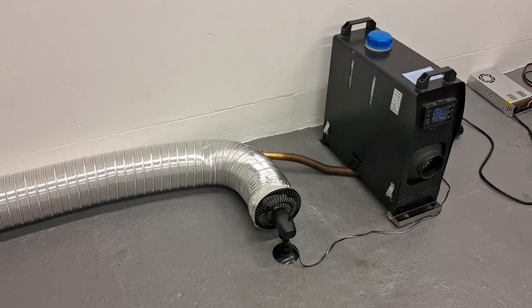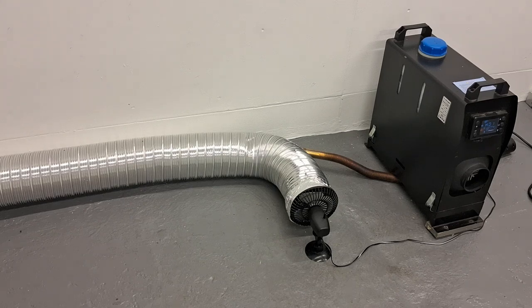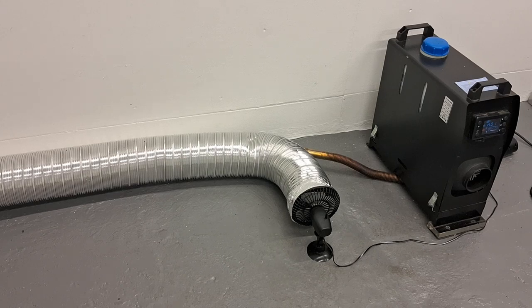Please give me some comments on how we could take this further and use it in our homes or workshops. The most important thing I found doing this small experiment is that it would be very important to have a variable speed fan, so we can adjust the fan speed to take the maximum amount of heat from the exhaust pipe without blowing it too fast. Also, with the fan going too fast it's probably going to be too noisy — this lightweight aluminium tubing is quite echoey and freestanding on the floor you can really hear quite a bit of noise, though it wouldn't be as noisy in most situations where it's covered up, insulated, or going out of the room.